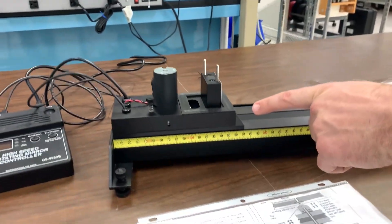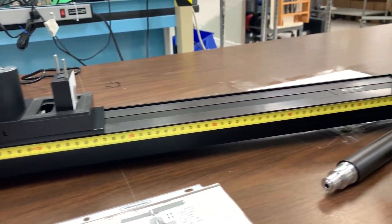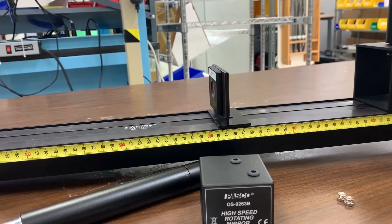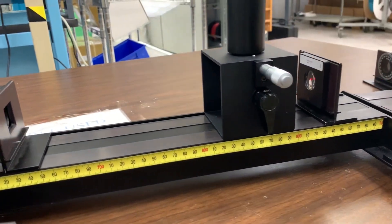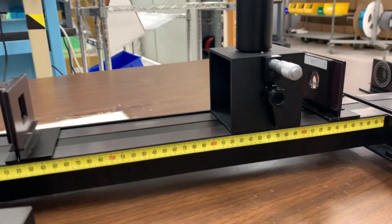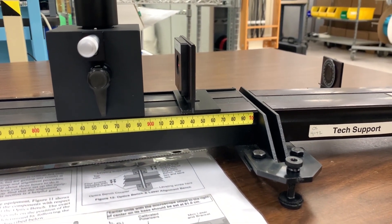The mirror starts at the front edge at the 17 centimeter mark, so 17 centimeters from the back of the optics bench. The 252 millimeter focal length lens is at the 62.2 centimeter mark. The front edge of the measuring microscope housing goes at the 82 centimeter mark, and then this last lens, which is a 48 millimeter focal length lens, goes at the 93 centimeter mark.